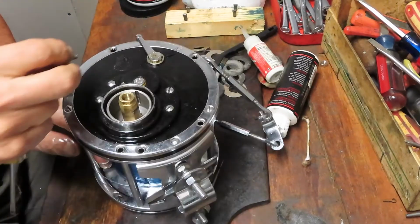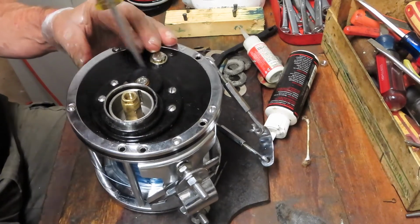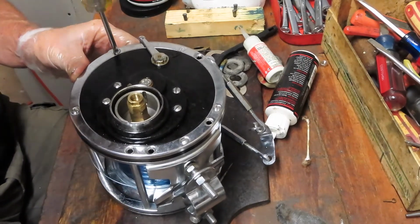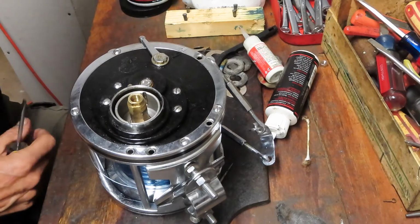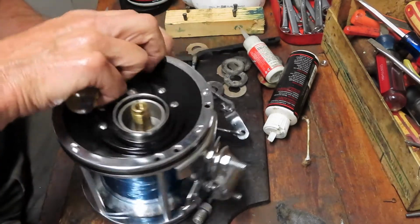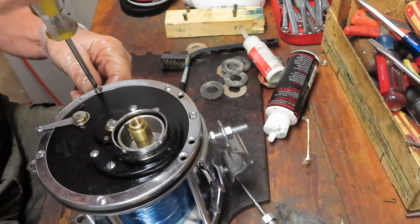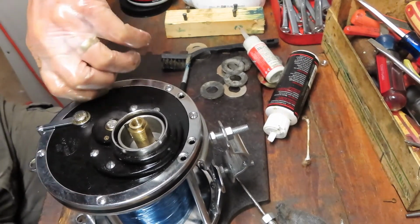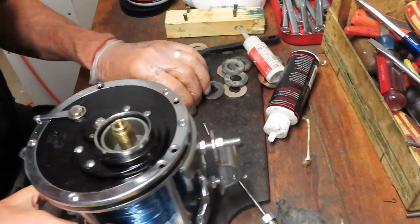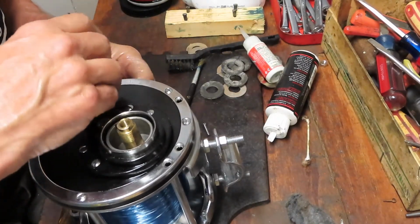All right, now I'm going to come up top here, put one of them into the lug here. I don't like to start with the lugs. And the reason for that is it's difficult to align them. And if you've got any kind of symmetry issues in terms of getting these out, then you get quite a juggling act going there, at least initially. All right, I'm not sure I'm through this lug here. Let's see, maybe this is one of those I'm going to use that pick for, to just do a quick alignment on it. Off by just a little bit, but it's enough.